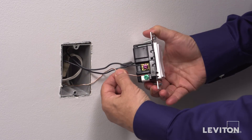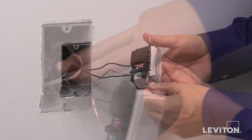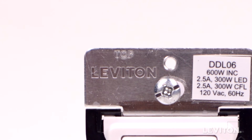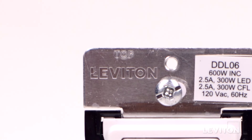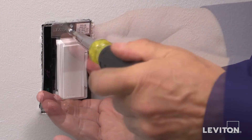The device is now terminated. Position all wires to provide room in the outlet wall box for the device. Ensure that the word TOP is facing up on the device strap. Partially screw in the mounting screws in the wall box mounting holes.